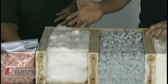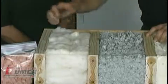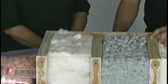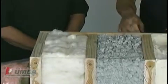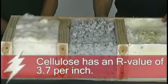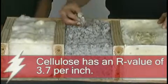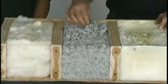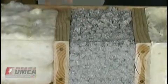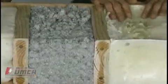Fiberglass is something most people are familiar with — it's been around for a long time and was the product of choice about 20 years ago. There's also blow-in fiberglass, more of that pink color people may be familiar with in their homes. This is cellulose — a very good product. It's ground-up newspaper, 80% recyclable. It has qualities of being fireproof, bug-proof, soundproof, and it has an air barrier. You can see there's a real difference between how much cellulose fills the gaps compared to fiberglass — there are visible voids in the fiberglass, which is a real advantage of cellulose.